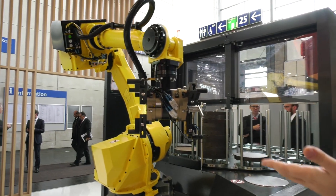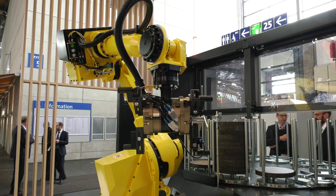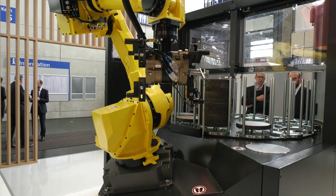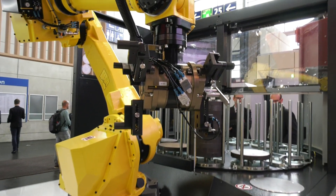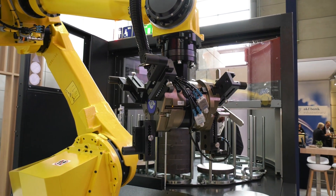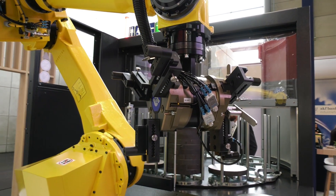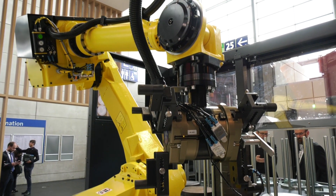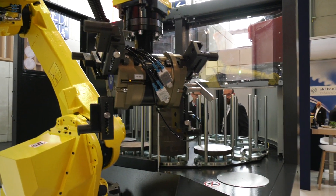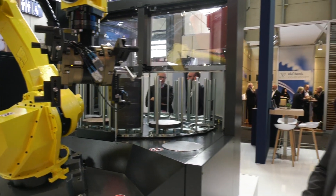Going around to find out what it comprises: first of all, the robot arm itself is now a 70 kilo robot arm — this is why they call it 'the Big', simple as that. The gripper on the end is the same good quality gripper but with obviously higher capacity: 35 kilos each end. That's big and chunky.